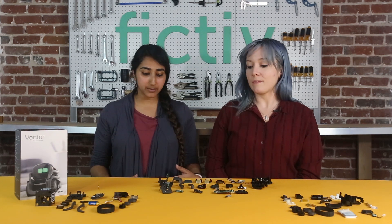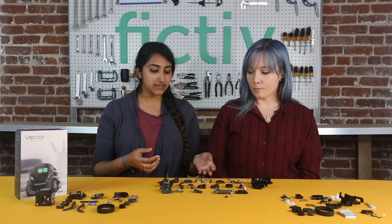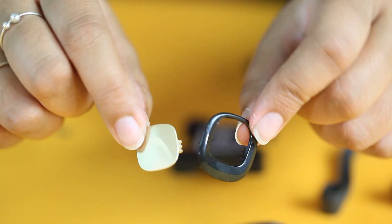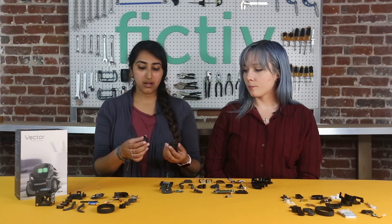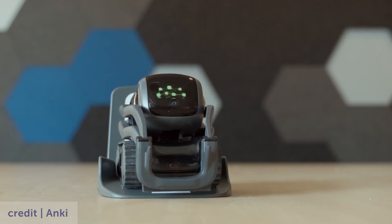The plastic parts are made of different materials. The clamshell for the head is made of polycarbonate, whereas other pieces are made of PC-ABS, and some parts are just ABS. These three different materials can cause different expenses when molding. In addition, the ear pieces look really similar but they're mirrored, requiring two separate molds, which adds extra expense. Within these parts alone, there are complicated gear teeth and various bosses that need to be molded in — so this is where the larger cost lies.